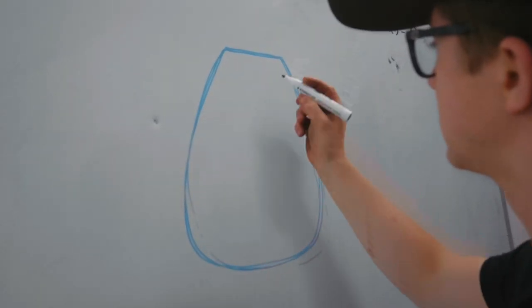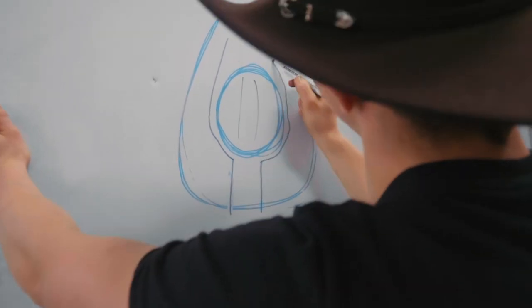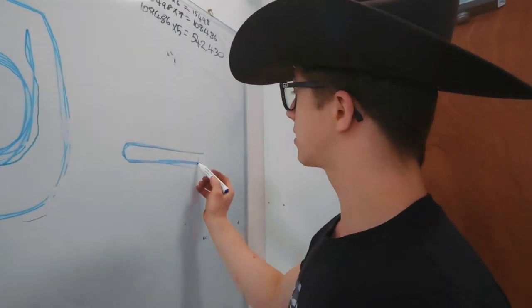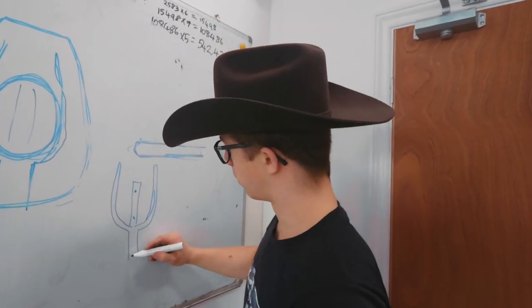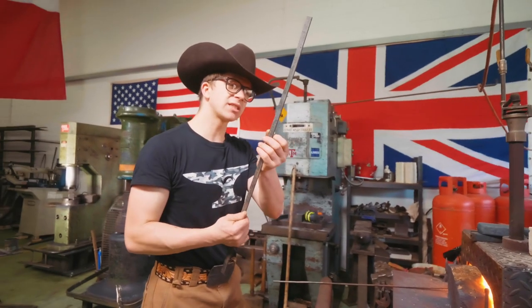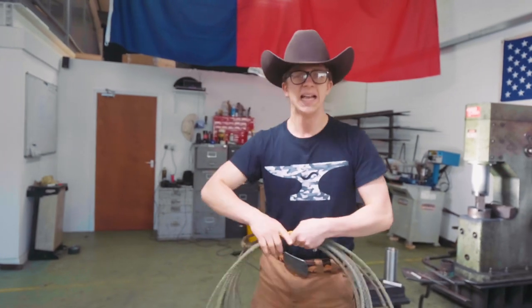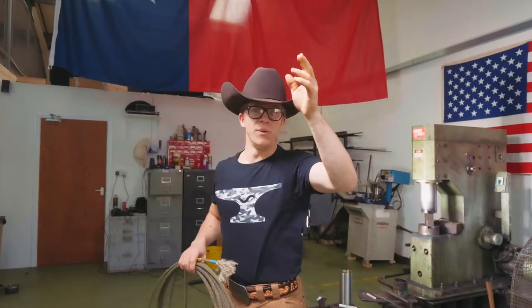This is the brim of our hat and this is the crown of our hat. Looking at it this way, what we want is two tines that will follow the crown around. Looking from our sidewards elevation, it's simply just going to look like a U. And looking at it without the hat, it's going to look a little like a pitchfork with a bend. I have a piece of 5/8 by about 1/8 inch material — 16mm by 3mm material. We're going to make one very long chisel cut and forge those tines down so we have a nice neat prong for the hat.